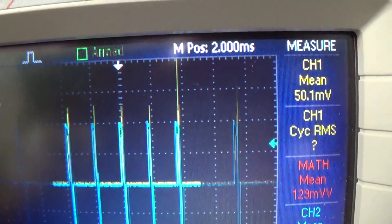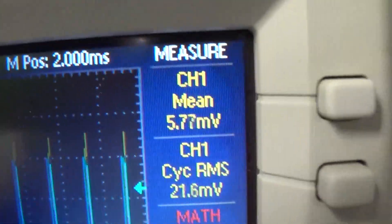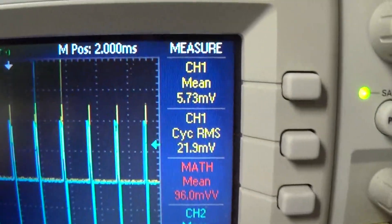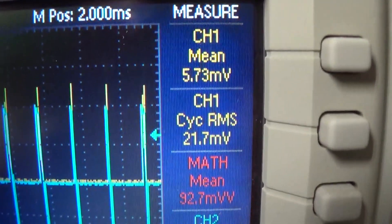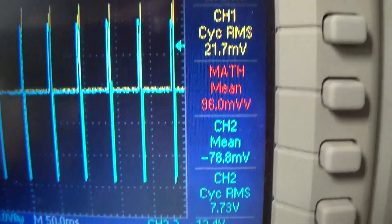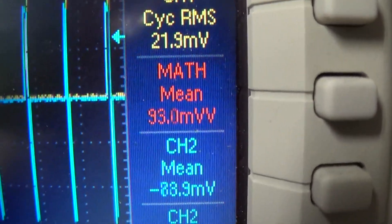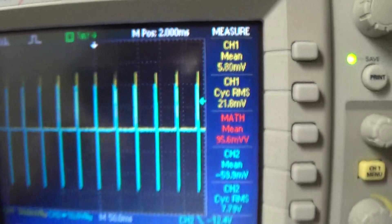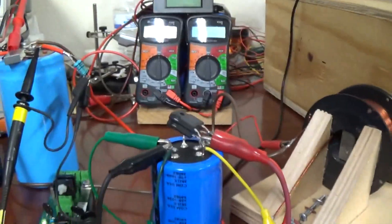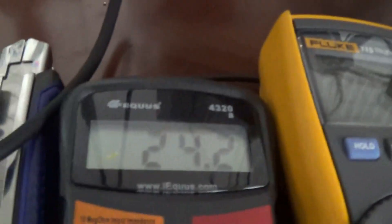Let's zoom out so we can put a lot of samples in our window and get some real data. Our means is now 5.7 millivolts, compared to previously 4.27. Our RMS was at 16 millivolts; we're now at 22 millivolts RMS. Our math was at about 70 milliwatts and now we're at 95 milliwatts. So we are definitely consuming more power in this configuration without the magnet rotor participating - and that's what's up for debate.